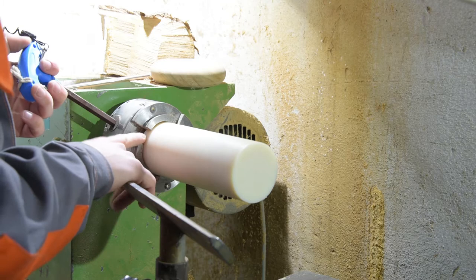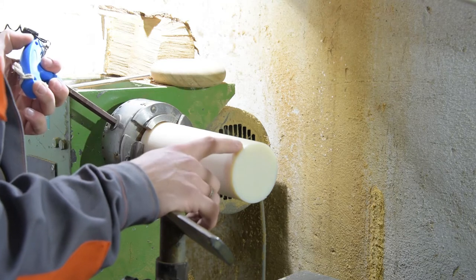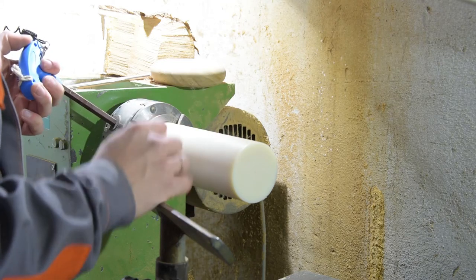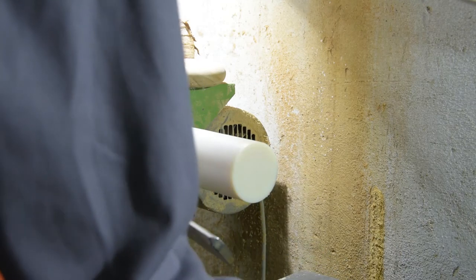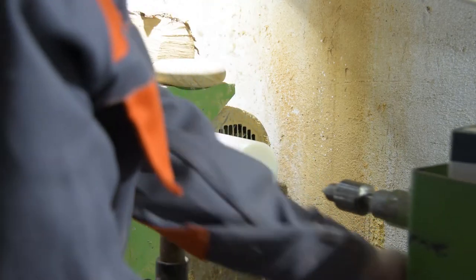This is not the most perfect fit, so I'm just gonna first of all turn down a tenon and flip it into my jaws. Bring in the tailstock.